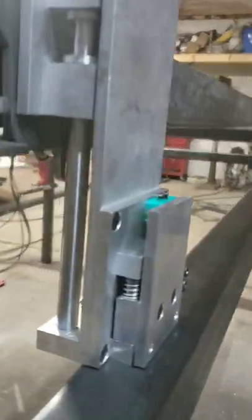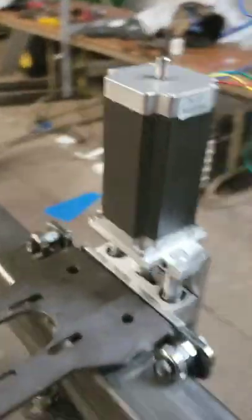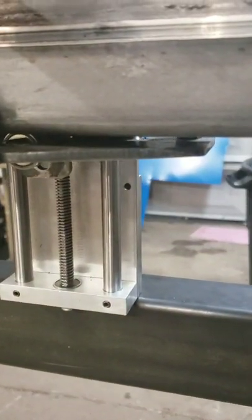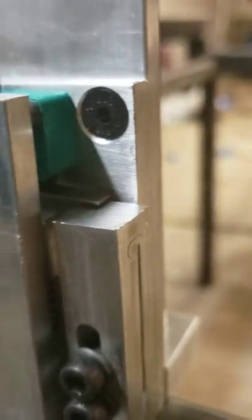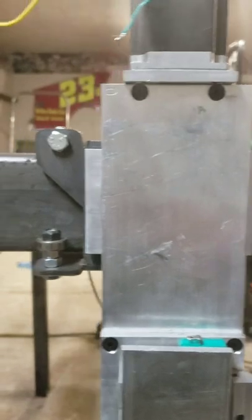There's a z-axis micro switch, and that's where the z-axis motor will go, coupled right there. You can see the screw drive on it. It's got the torch height control micro switch on it, so this will move up and click that micro switch so it can find the top of the sheet and know where it's at.